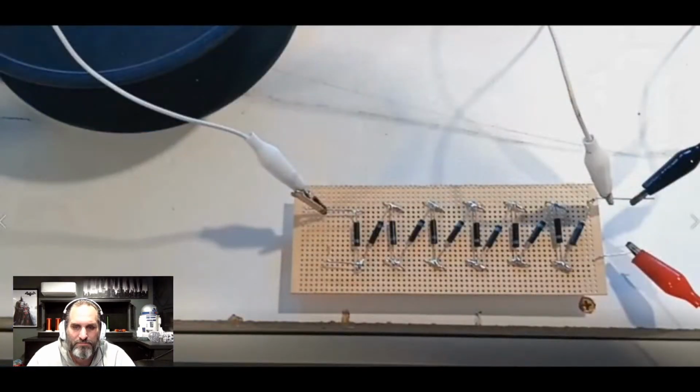As you probably noticed in the last video, I switched from a DC flyback to an AC flyback with a voltage multiplier on it. You're probably wondering how I did that. Well, okay, real quick, I just got to tell you this. This is in negative. The only difference between this and a positive one is the direction of the diode. So if you flip the diodes the other way, it goes positive on you. Just understand that and make sure you flip your power source accordingly.